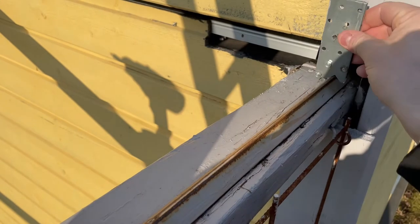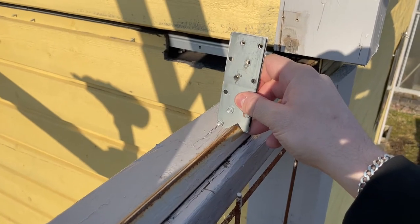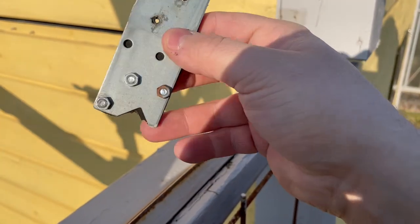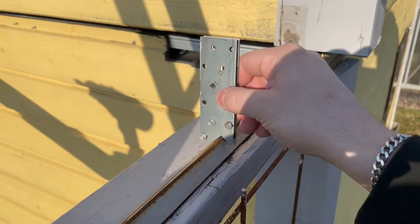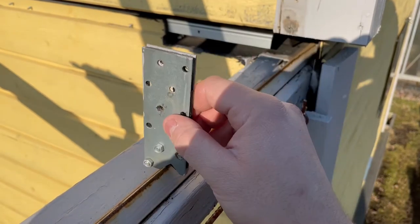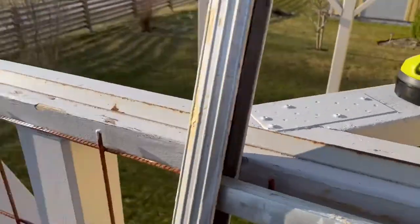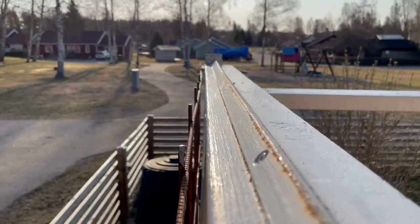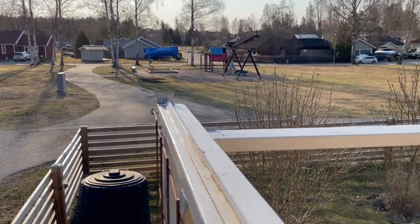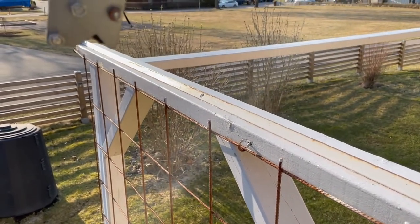This is how they looked — actually quite simple. I had problems with ice buildup being too strong, so this scraper wasn't strong enough. I tried cutting in a rubber seal to scrape water and such, but that didn't work as planned. So I'll just get rid of them and let the roof roll down the angled iron toward the end — these scrapers were getting caught on the end stop over there.